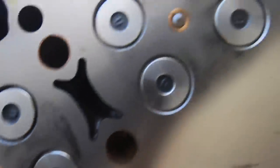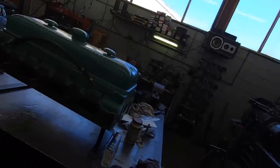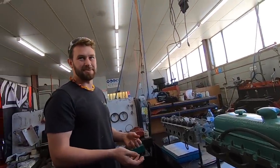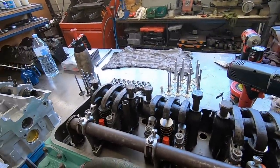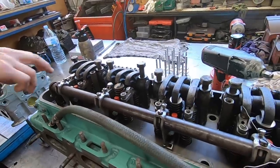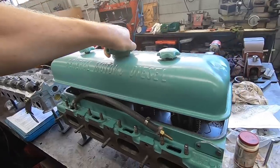It's just going to take another week or so. Most of the delays have been due to problems with parts, which has honestly been my fault — I got the wrong camshaft because I saw a cheap one and went for it. It was obviously for a Detroit Diesel 4-71 but for a left-hand engine, not a right-hand engine. Also it turned out the sleeves for the cylinder liners needed to be oversized — the block had been machined before, so the sleeves I had weren't big enough. I now have a set of standard sleeves and a left-hand rotation camshaft if anyone wants them. When I get it back from CDA I'll get it sent to the workshop, start putting the blower on, the heat exchangers, all that kind of stuff, then we'll be ready to drop it back in the boat.